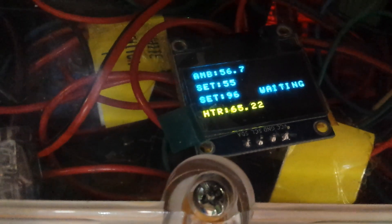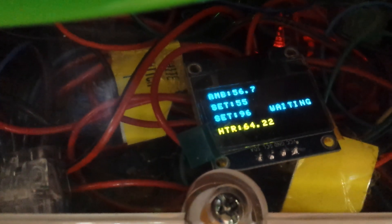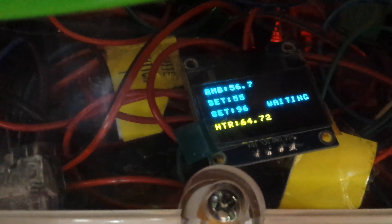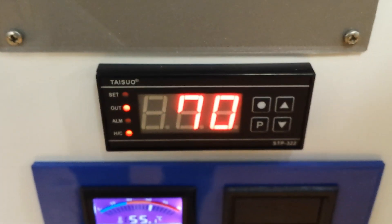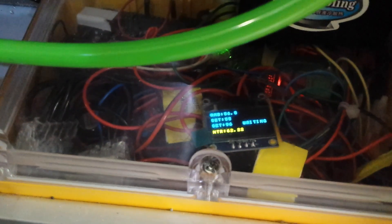If the temperature were to drop below 55°C, it will pull on the heater, which will heat up to around 96°C. With the way I've got the Arduino set, it holds around plus or minus 4 degrees on the 96, so it tends to hold at about 100°C. If the heater's silicon pad itself goes above 110°C, this will switch the alarm contact and shut off all heating.